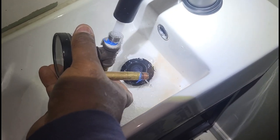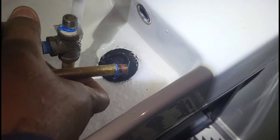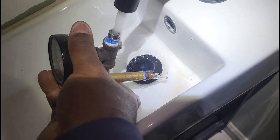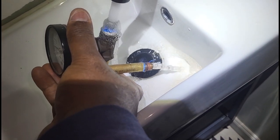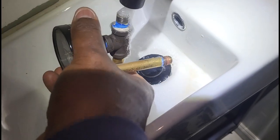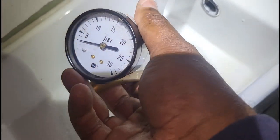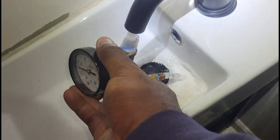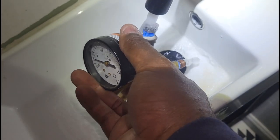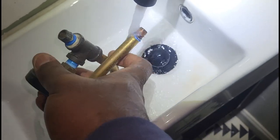You want to run water through the pigtail until clear water comes out the other side. What can happen is gunk builds up — and you'd be surprised, it doesn't take much buildup for the pigtail to clog. Any obstruction in the pigtail is going to cause your pressure control not to correctly sense adequate steam pressure in the boiler. Alright, this looks good.